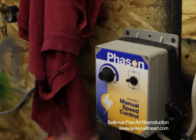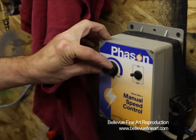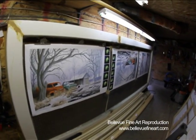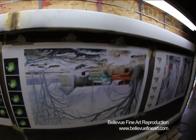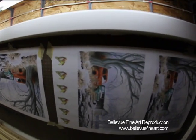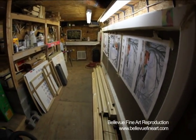In order to do this, we've built a spray booth that looks like a reverse hockey table. Here you can see me turning on the variable fan speed controller. This sucks the canvas to the pegboard — it's got air channels in the back — and it also helps clear the air of the spray as you're doing it. We've also got intake and outlet fans on the sides, and all of these have filters on them.